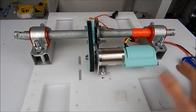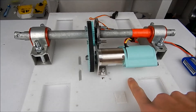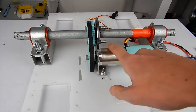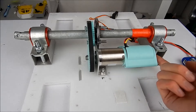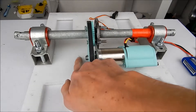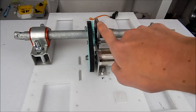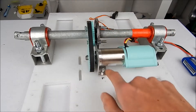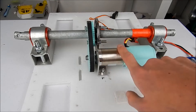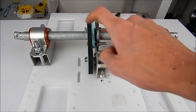So this is now kind of set up. I haven't really filmed a lot getting to this point because this was only supposed to be a really quick test, but it has given me no end of issues. I have a brushless motor in this nice plastic housing with some 3D printed mounts on either end — one goes into a gearbox and the other holds a bearing that supports the back of the shaft. I also have a mounting plate up the front here, and you can see I've got two different slots for this because my CAD model for where the center hub section is, is off. This is the first time I've ever had belt tensioning built into the robot — we can undo these bolts and slide the whole assembly backwards, and that tensions up the belt.